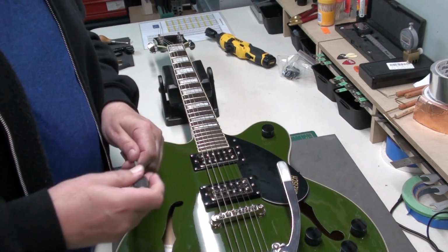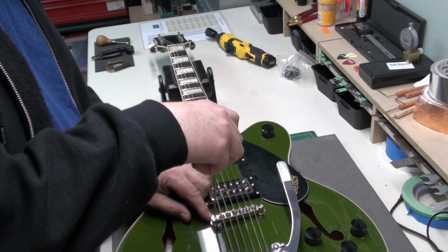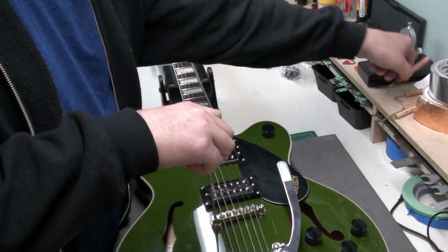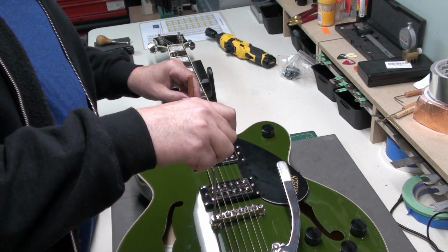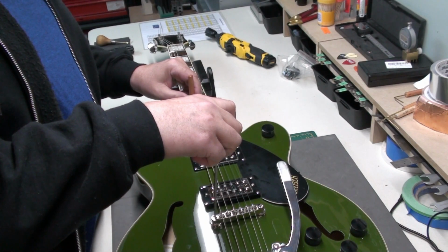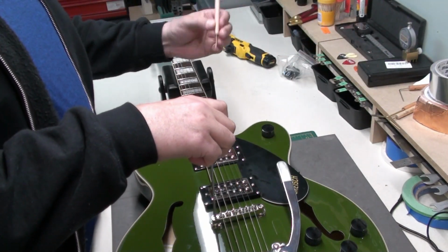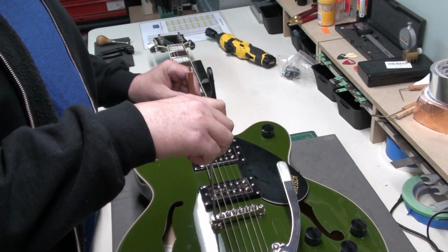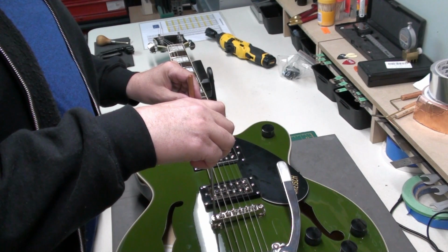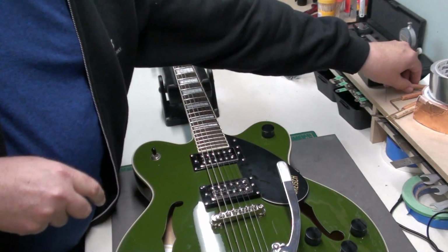So there's a thumb wheel, but there's also a screwdriver, and it's generally a little easier to use the screwdriver to do this. And I'm going to put my gauge under. And I don't mind it just a little bit higher than 4. You know, 4.5. Not quite 5, but you know, 5 is okay, and I'll use the 5 now. Yeah, so I think we're good right there. 4 passes under, very little bounce. Okay, good.